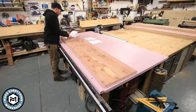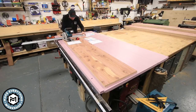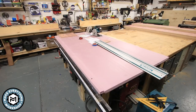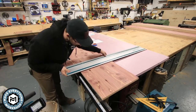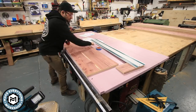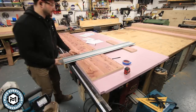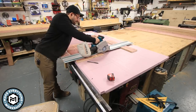Once that was done it was about cutting up my shelf parts, and this can be one of the most time-consuming parts of building any sort of cabinet. For this I used my 36-volt Makita track saw - it uses two batteries instead of one. I put pink foam down underneath it, and what's nice about this setup is I can just lay my boards down, mark out my cuts, drop my track on there, cross cut, and make all my shelf cuts without worrying about depth. This was sort of the first time I used the track saw for this purpose - normally I'd use the table saw or miter saw - but I felt like this gave me the best result I've ever gotten doing this operation.